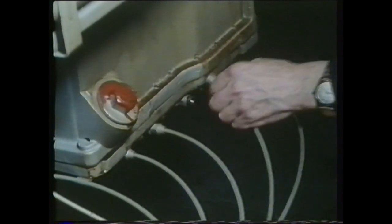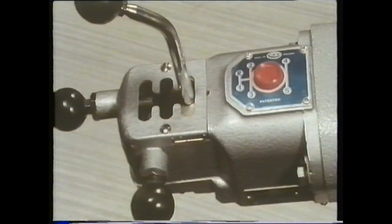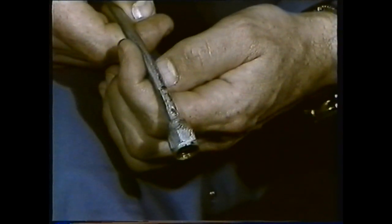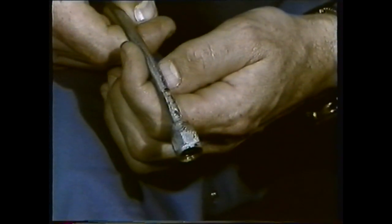With the air tanks of the vehicle in a charged condition and the change speed lever in neutral, release the air inlet line here that feeds to second gear. Now select second gear. If air escapes from the end of this pipe when it's released — and you'll hear if air is present — then the control system is functioning correctly, and it's a clear sign that the gearbox is at fault. However, if there is no air escaping from the pipe outlet, it means that there's a fault in the control system. Therefore, first replace the air inlet pipe and proceed to examine the control system.